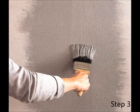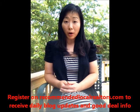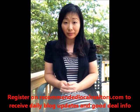Using this technique, a brush load of paint can cover an area approximately 2 feet by 1 foot. Work across and down the wall, painting adjacent areas and then brushing them together. On most occasions, you will need 2 coats of paint. Type 2. Mottled coat of paint.